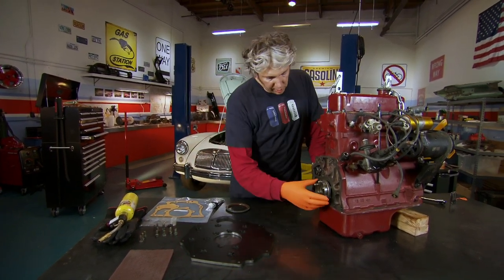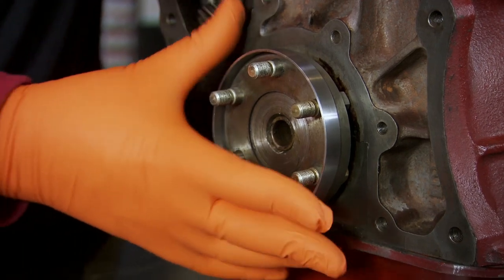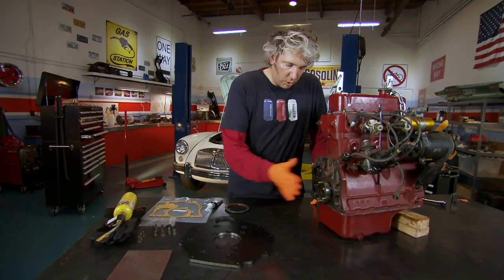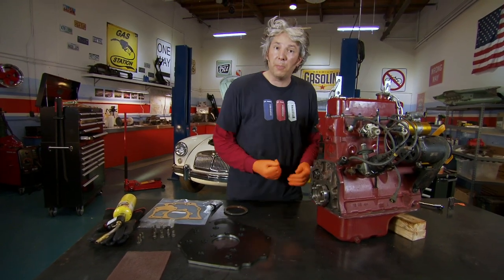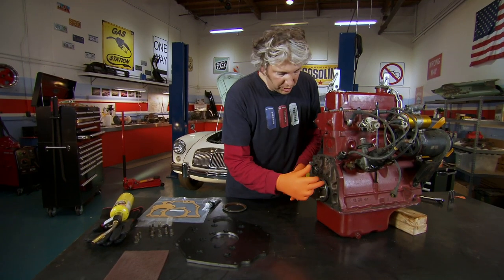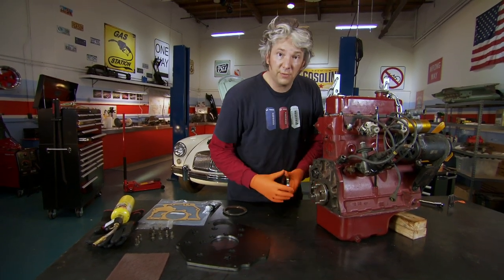The first thing I have to do is get the slip ring onto the crankshaft here, but it's an interference fit, which means I actually have to either heat the ring up or tap it into position. So I'm going to do a combination of both because I'm slightly nervous that once it is hot, it'll be a bit difficult to handle and I might push it too far over the end of this flange.